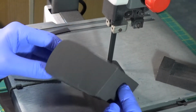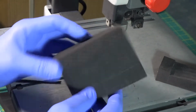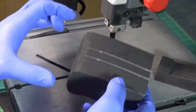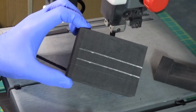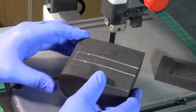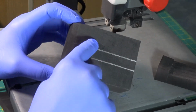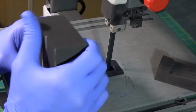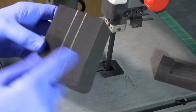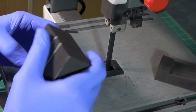All right, look at that. Whoa, that is one thick handle right there. Okay, now what we did was we bulked up this to 2.5 inches, which somehow we messed up in our calculating, and that's way thicker than we need. So we've got a 1 inch measurement and we've got a 1.5 inch. Looks like we'd be pretty good with a 1.5. So we're going to cut this off so that we've got a 1.5 inch handle, which will be much better.